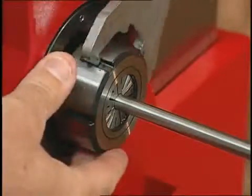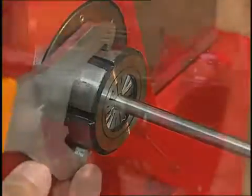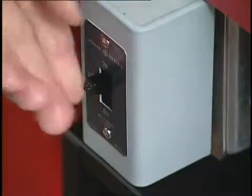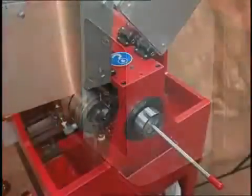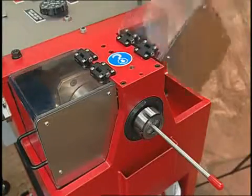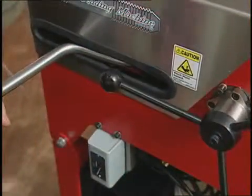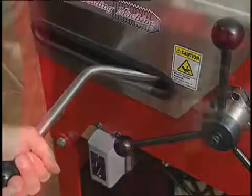We are now ready to begin the coning process. Pull the lever handle to move the indicator to the coning position and turn the machine on. When the unit is operating, it is important to keep the shields lowered to avoid oil splatter. Rotate the coning feed handle towards the front of the machine, moving the coning tool towards the tubing. You will be able to tell by feel and sound the coning process is underway. Once a full stop is reached, reverse the coning feed handle to retract the coning head from the tube.